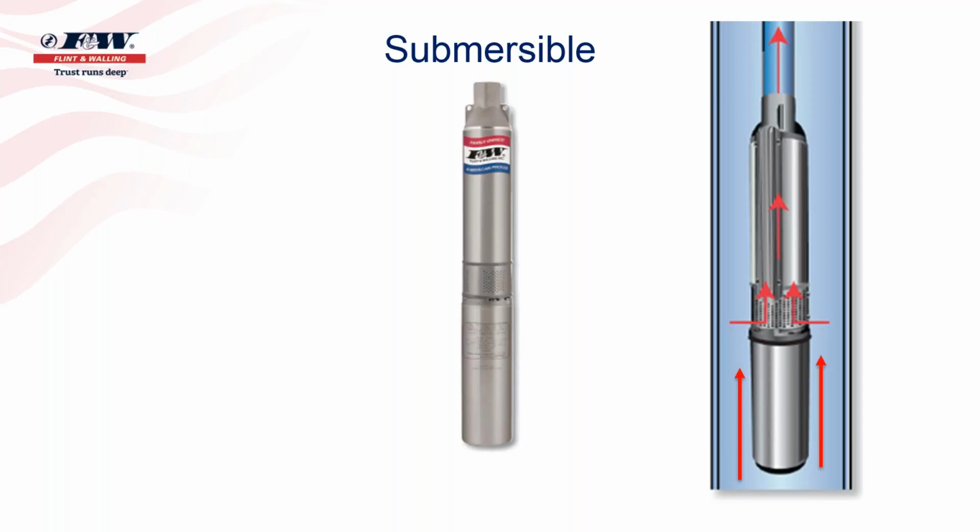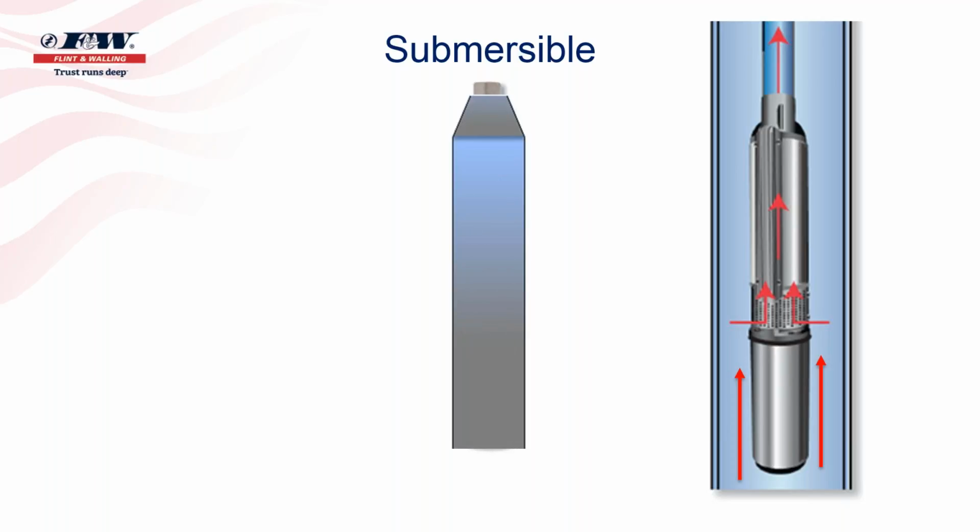As I mentioned, the motors on these submersible pumps are also water cooled. So again, as the water flows past that motor to get into that suction screen, that's what keeps the motor cool. On some applications, when you get into larger horsepower, above 2 horsepower, and these are put into pond systems, contractors will shroud the pump. Because if this pump is sitting out in the middle of a pond and it's a large horsepower motor, there's a risk that that motor could overheat. The smaller horsepowers, we're not concerned about in the least. And again, at 2 horsepower or below, the technology and motor development has evolved so much over the last 20 years that the smaller horsepower motors are not a concern for overheating.